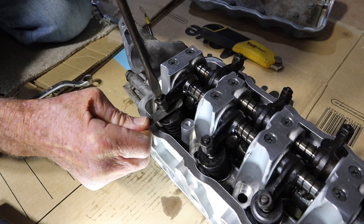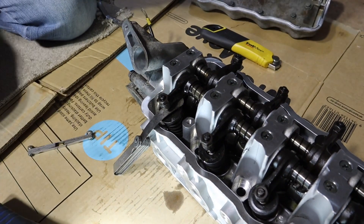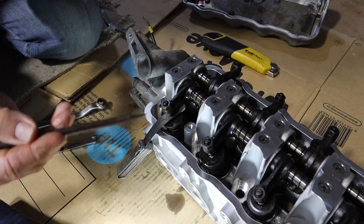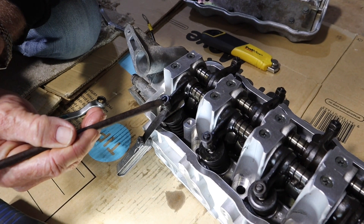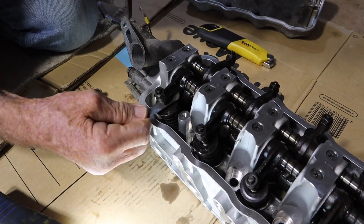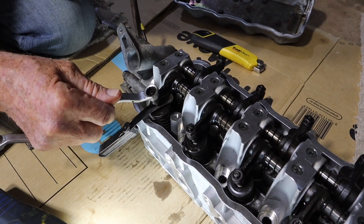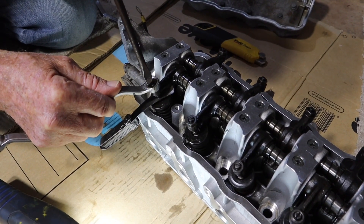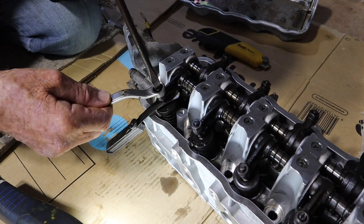You really want to set it so it goes tight — so we'll put it so we can just barely move it and it should be close. Now when I tighten up the lock nut, it's actually going to pull the screw upwards and it's going to make that slightly looser. So as you can see, I can barely move that. We'll put the spanner on here and the screwdriver there so the screw can't move, and we tighten this up.